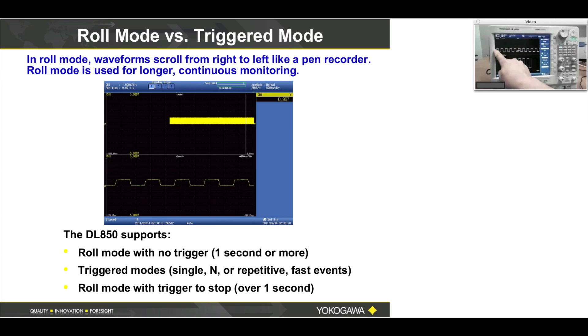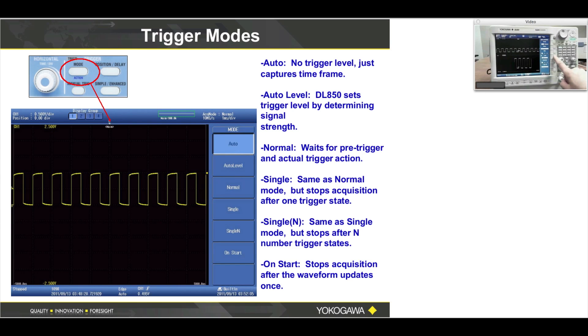You can watch the little arrow over here go up and down when you adjust the source. I'm adjusting level and my trigger level is moving up and down. Make sure that level is about one-half volt. So we talked about the trigger mode here. If everyone will press the Trigger Mode button and make sure you select the trigger mode here.